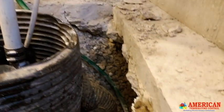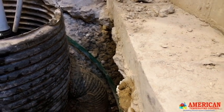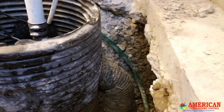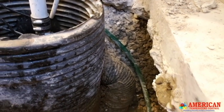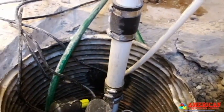You can see the drainage tile snorkels up, which means the drainage tile can't drain until it's completely saturated. You can see the groundwater — we already pumped it out once and it's coming back. We'll replace this whole pit here.